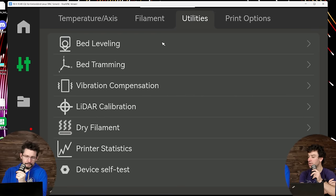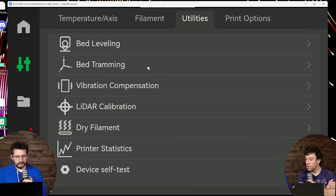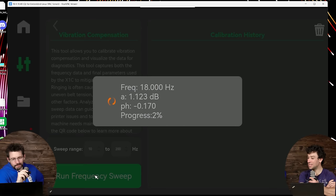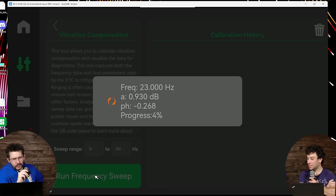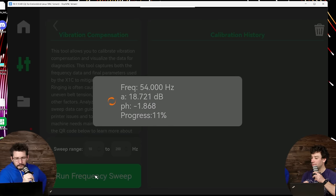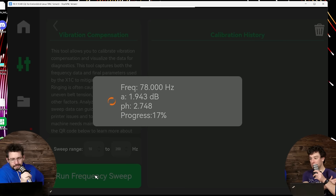Also hit vibration compensation — run frequency suite. We're going to find all the resonant frequencies of your setup. This is a slightly different readout than you're used to. Internally, the printer commands the tool head to vibrate, then an accelerometer inside measures the response. You can see the amplitude going up and now back down. How loud it is in decibels corresponds to the gain — as it gets quiet at lower frequencies it goes into higher frequencies. Below zero means it's getting less movement than commanded.